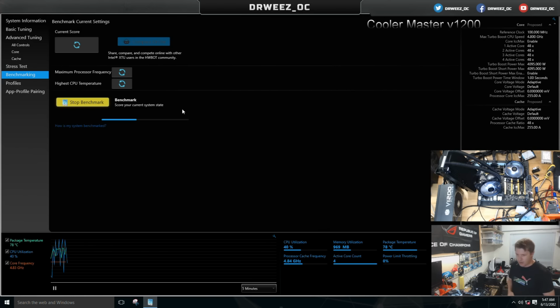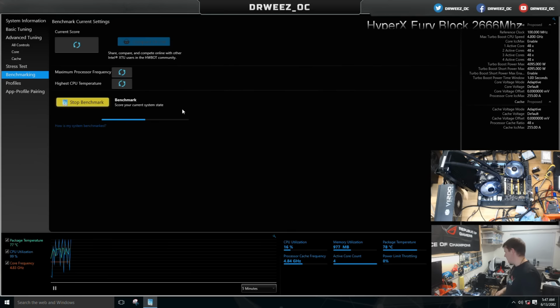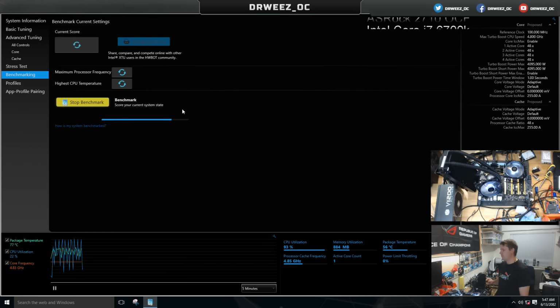Let's just move along. I've still got two other benchmarks to do, and we've only got an hour and 20 minutes remaining. The nice thing is once you've figured out what your maximum clock is for the first benchmark, to scale up and down with the other two should be quite easy. So it should be quite doable. The problem I have is that GPUPi is a relatively new benchmark for me. It should be similar to SuperPi, where memory clock and CPU clock should play a role. But I believe from my past experiences, there are some things to look at.